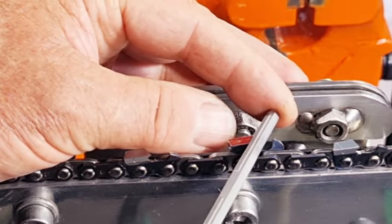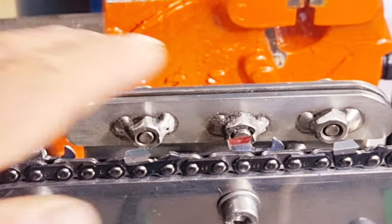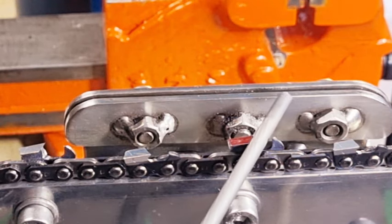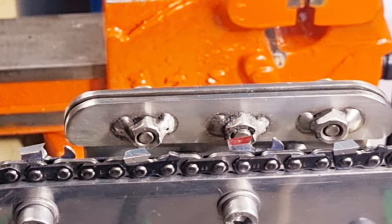No twisting — if you put that file in there slightly twisted to the left or the right, you're going to change the geometry and it won't sharpen properly. Be aware of that. That's probably as much as I can say about Hexa filing. There are many mistakes you can make in grinding or filing — you just need to be aware of those. Be consistent when holding the file, pushing it forwards, not twisting left or right. A round file is much more forgiving — if you twist it either way you won't make mistakes, the only errors are filing too high or too low.